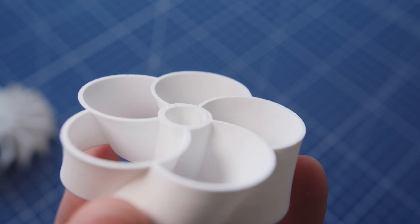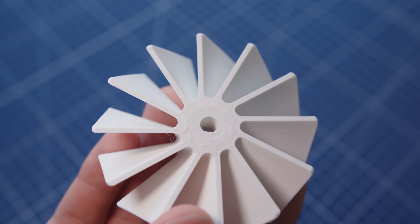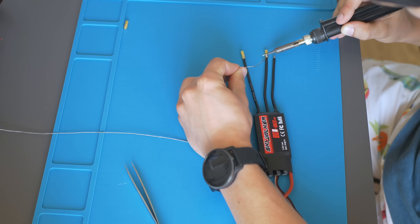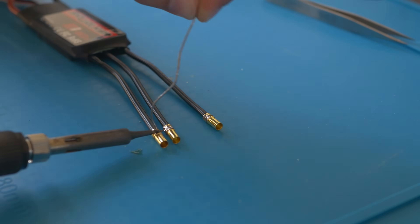Filling all the spaces between layers and then sanding is not really doable for such small fans. Soldering these connectors is pretty easy, but you have to know how to do it properly. You have to heat up the whole connector and then insert solder into the little hole on the side — that way it's super easy to solder and also incredibly strong.